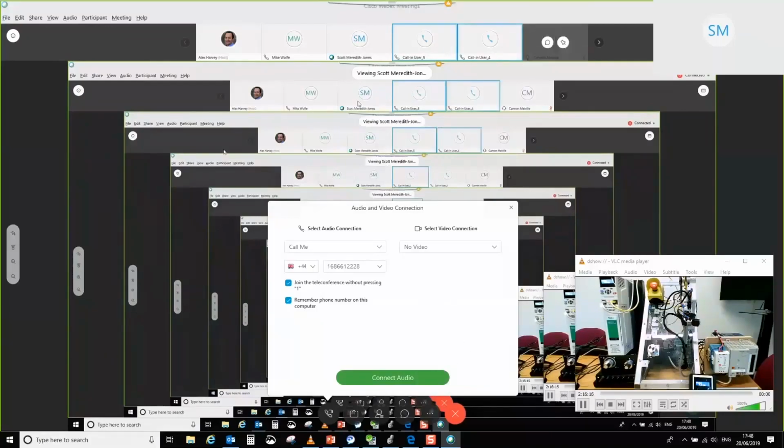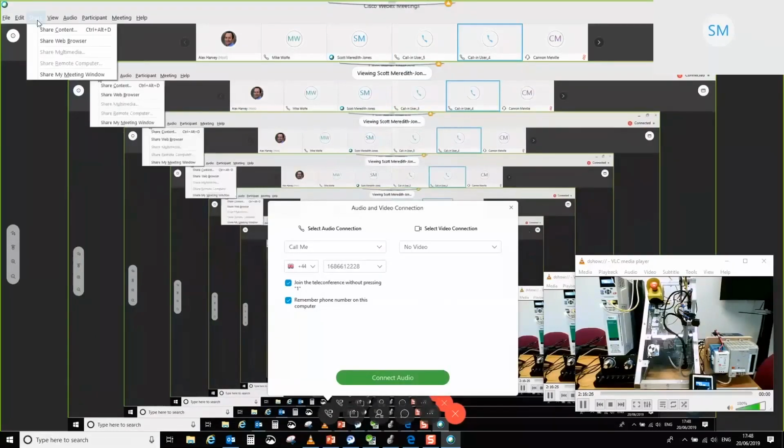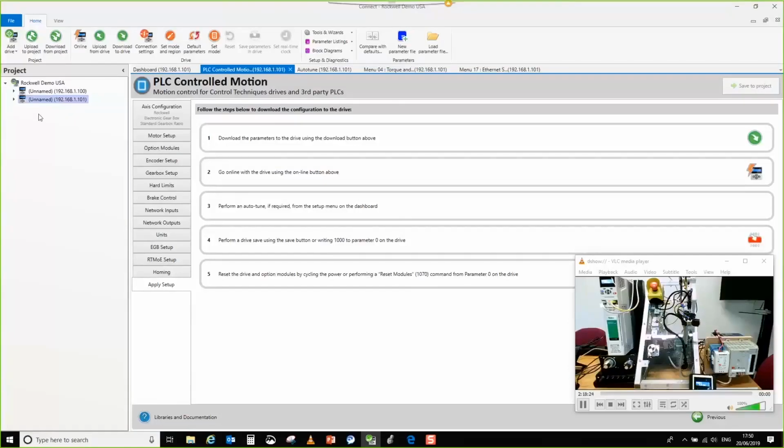I'm actually doing an application now with that, and it's not very clear when you're doing a dual loop application. I have a 50-to-1 ratio between the master and the feed from the position versus the other, and it's always throwing it back as the inverse of what my slave user units are, which is not correct.